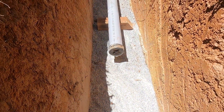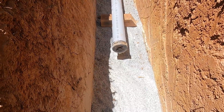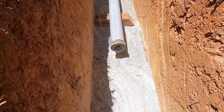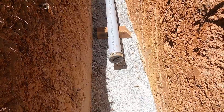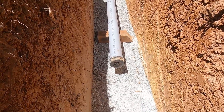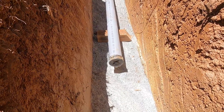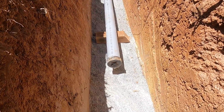One of the things we did was we got a couple of three-inch rubber plumbing end caps, and we're sticking that on the end when we drop it in the trench. So when I'm wiggling it around trying to get the glue on and whatnot, this end is not getting filled up with sand. It's helping keep the inside of the conduit free of any debris.